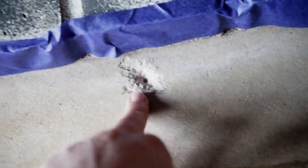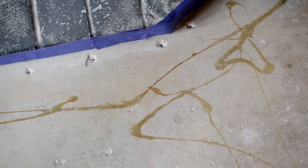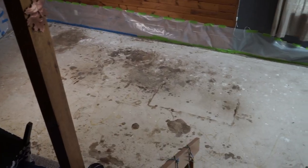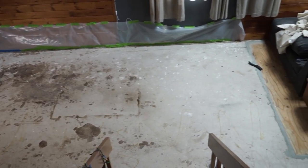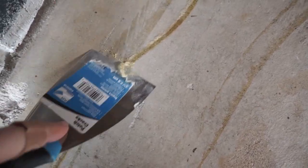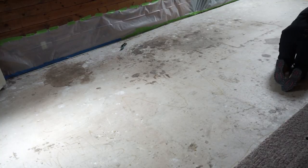Right here you can see a hole — that's where the tack boards were for the carpet. Then you're going to need a scraper, because under your carpet is some foam, and under that foam there's a ton of dust, but under that dust there is glue, and sometimes that foam sticks to the glue and you've got to scrape it on up. After you do that you're going to need to vacuum, and then vacuum again and again.